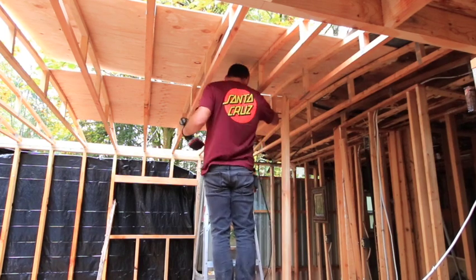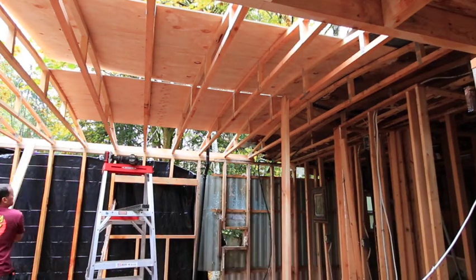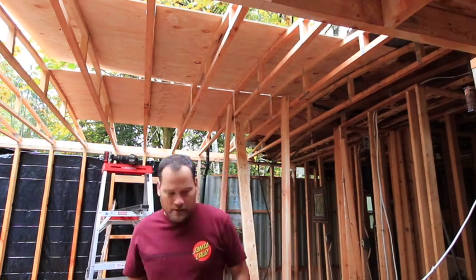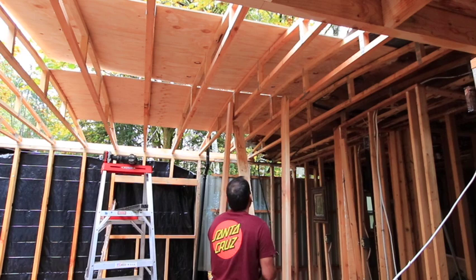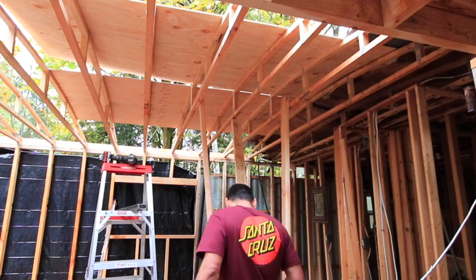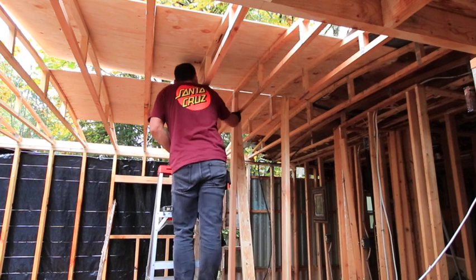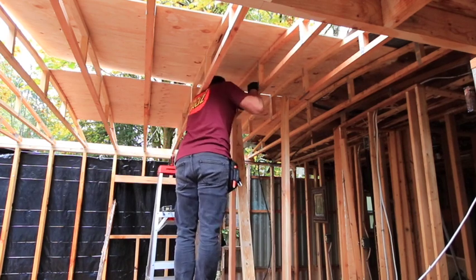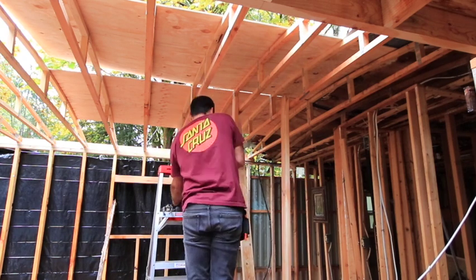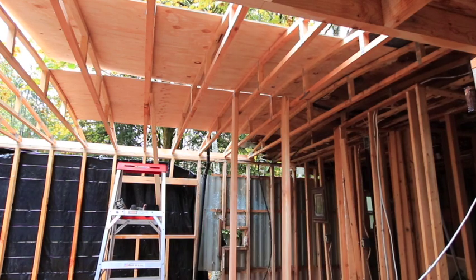But for this first section, they go a lot farther than that. So is what it is, but I'll explain that in a few minutes when I go up there and give you a breakdown. But for now, I'm just kind of eyeing the level. I bought one of those cheap laser levels that I'll use at some point. But just kind of building a false wall for now by just putting a 2x4 on an angle, kicking it so it pushes the truss up a little bit, and then screwing it in with a straight 2x4, pulling it out, and then going on to the next.